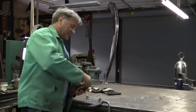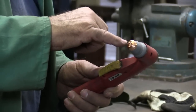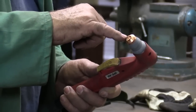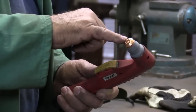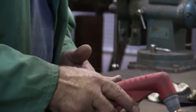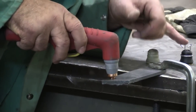But to make things a little better, in my opinion, we can get rid of this cup. Now they have this drag cup and it just goes on in the same place. What you see on the end here is this is a drag cup. This brass part is actually insulated from the tip, so this is cold electrically. It's got little reliefs cut in it so the sparks can come out of there. But this allows you to go right down on your metal and drag across your metal without having to use that little wire guide.